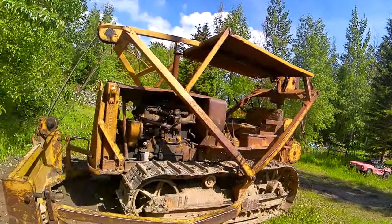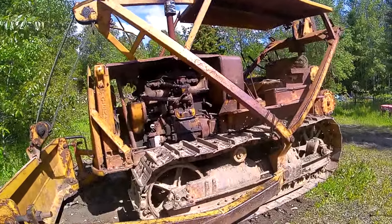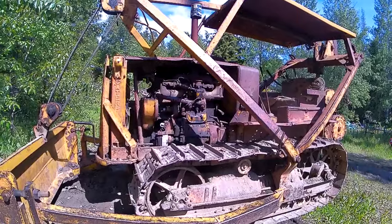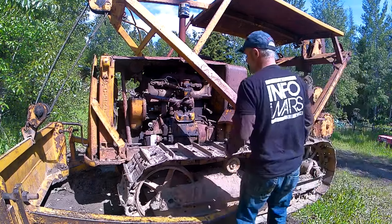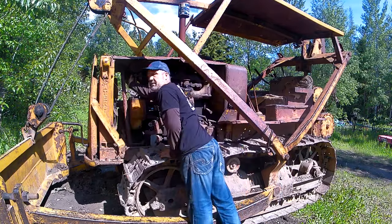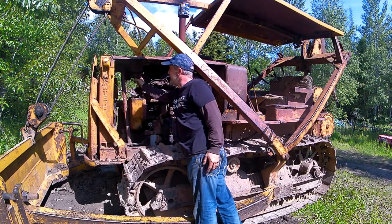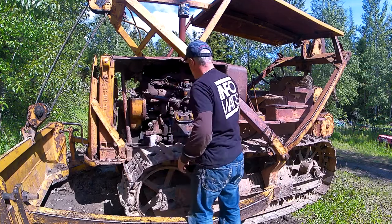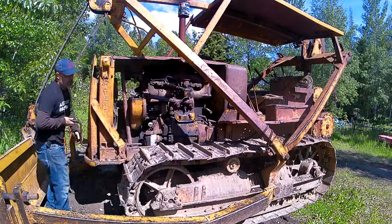Hopefully it doesn't take too many cranks to get the putt motor going. It usually doesn't. I got it tuned up pretty good. I did take the carb off and cleaned it all out and went through the jets and all that. And let's see if the adjust is coming a little bit better. There we go. So, let's see what happens. I want full choke out that way. Feel on this little butterfly valve here. This is a water separator for any gunk and water and moisture in the tank that comes in here rather than running into the carb. Works pretty good actually. Yeah, I got that open. That's all set and ready to go. Let's give her a shot.